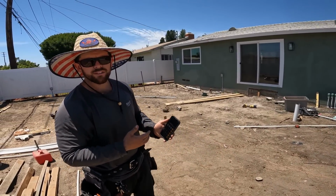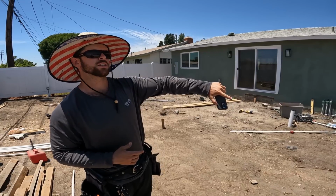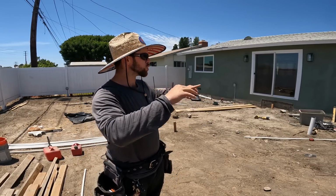And if I was to go any heavier, I would get better slope towards the corners, but a lot heavier fall on the edges. And I want to keep my slope pretty gradual. I don't want to have a massive slope towards the drains. I want to keep it relatively flat. So I'm happy with 2 inches for our slope to these drains.